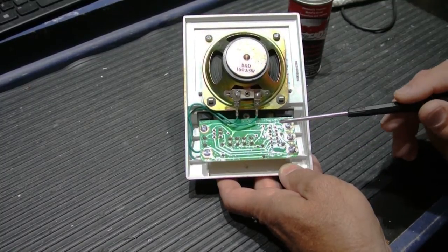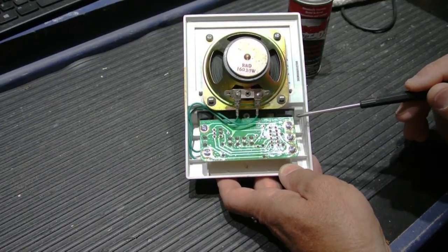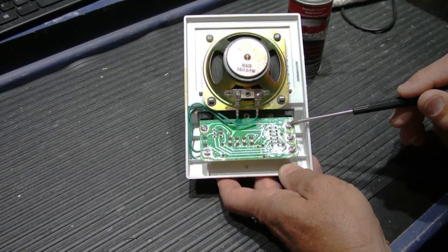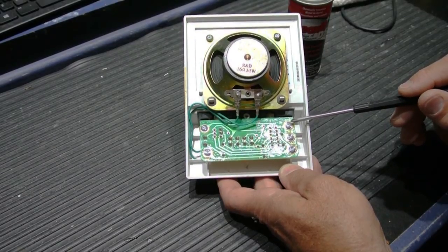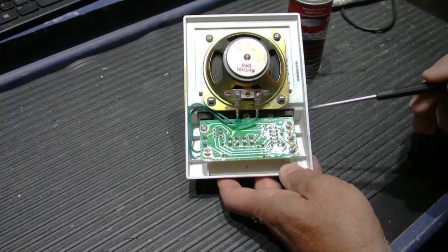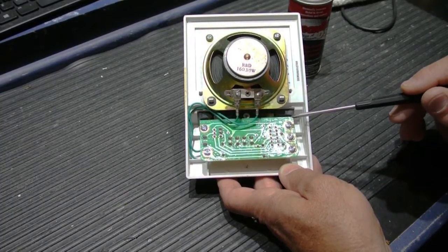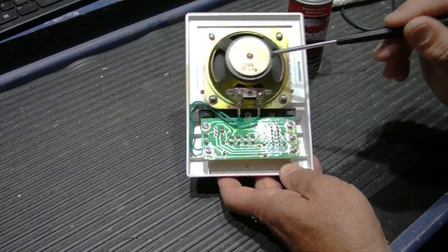The only wire that's individual or special to your apartment is the ring wire. The ring wire is the other end of the wire that comes from the button at the lobby directory. So when someone pushes apartment number 4, which happens to be where you live, it makes a connection to this individual ring connection, and only you hear the tone through the speaker.